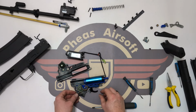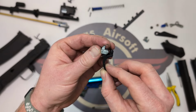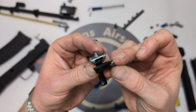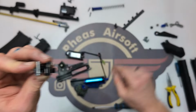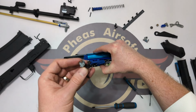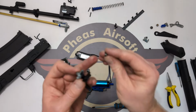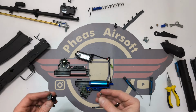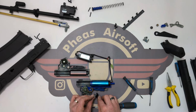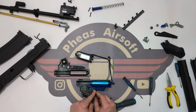So, that's in place. So the trigger then. You've got two parts to the trigger. It anchors on this front bit here. And as you pull it, this part here gets pushed back like that. And what we have is a spring that sits like that on here. Now what you'll see is there's a tiny little hole. Let's see if we can spot it. There's two circular holes there for those two pins there, and there's a little tiny gap in the corner just up there where that little short post will sit. So I'm going to seat that first like that. And then I'm going to drop those in together as a pair. I'm going to put the front one in first and the back one. Right, I can see that they're in there and I can see that that's working, pulling the trigger.